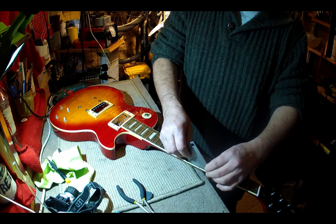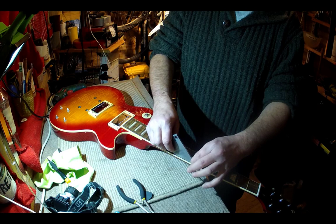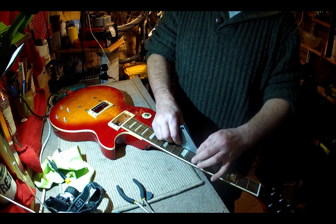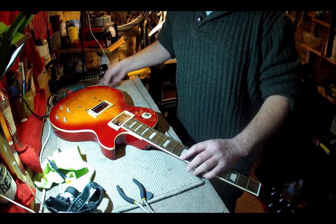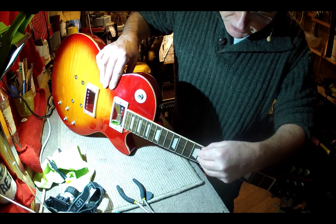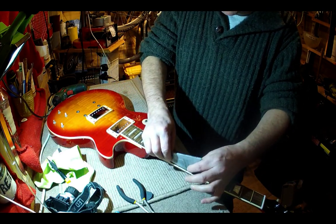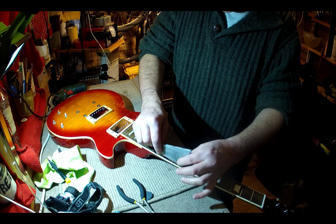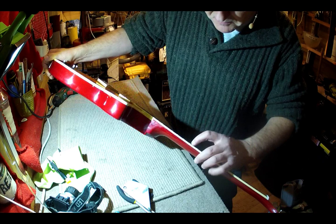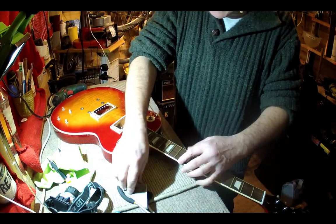So far, that's not massive, but there's a fair few. Oh, there are some then which are quite severe. You can hear the scale of the knocking. That's quite a pronounced high spot. And often you'll find, if you see it visually, you might see the ends lifting, if that's a really big rocking one. Ooh. So again, that appears to be rocking at this end, so I would expect to see this probably free from rising up a little bit. Yeah.